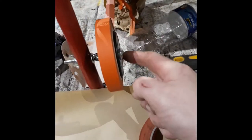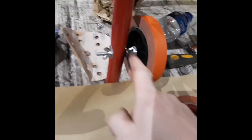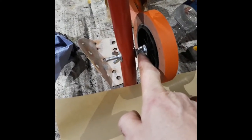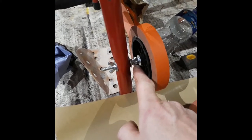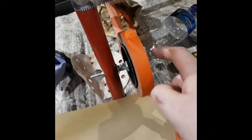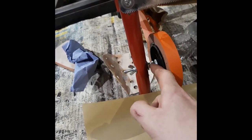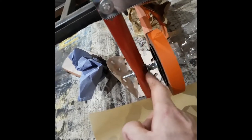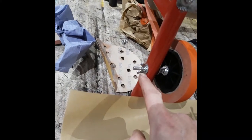What I did was, I put the bolt, that's one bolt going all the way through, I think it's 120mm. I put a washer on this side to stop it slipping out, a washer here. I got my own lock nut, a nylon nut, and I screwed it in. So this is pinched between the head of the bolt and this lock nut and washer here. So that's held out to the end. Then I screwed in a wing nut back to back with a washer, and I did the same this side the opposite way, washer and wing nut.